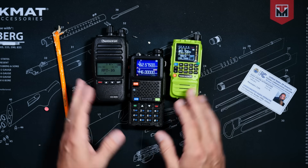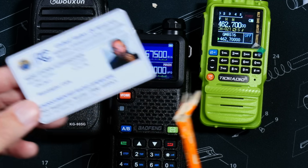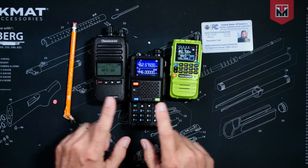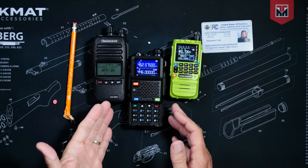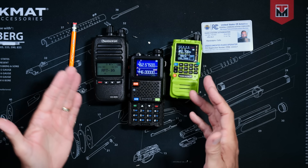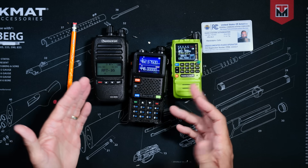The FCC says thou must say your GMRS call sign over the radio at least once every 15 minutes, if and when you are talking on the radio. So if your call sign was, say, KMG365, you would simply say at the beginning of your transmission, 'This is KMG365. How is the weather today?' And if someone in your immediate family was sharing your call sign as allowed by the FCC, they would use that exact same call sign the exact same way. Or, optionally, you could add a station letter or number to the call sign just so everyone can tell you and your family members apart over the radio. You would say, 'This is KMG365A calling KMG365B, do you copy?' or 'This is KDK1 to KDK2, do you copy? Our telephones don't seem to be doing too well — are the lines down by any chance? Over.'